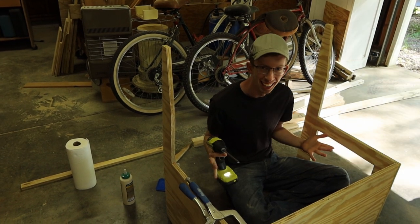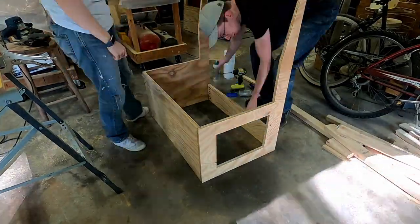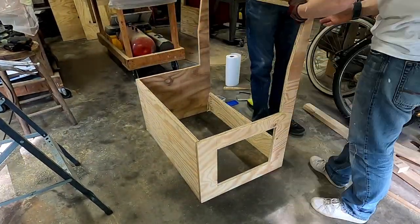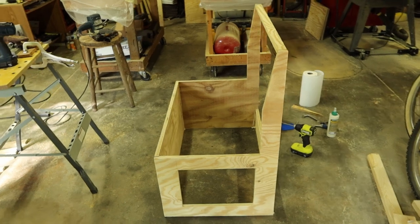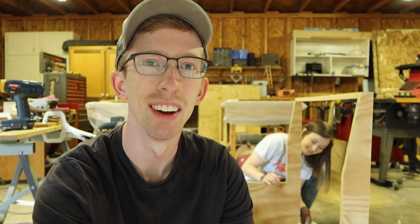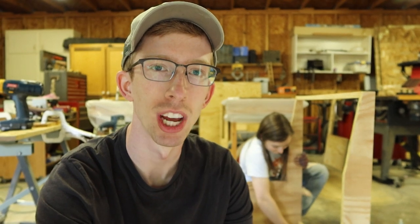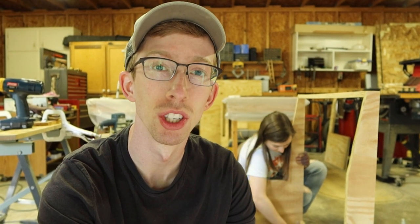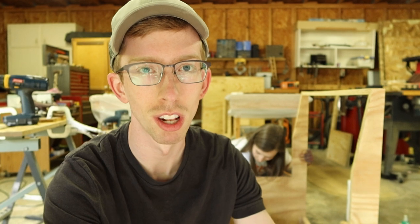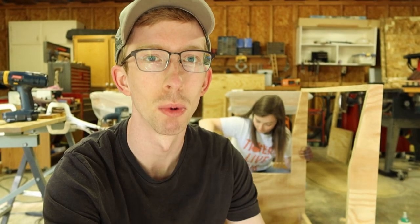Sitting in our dinette, and a few minutes ago I wasn't, and I haven't moved. All right, well, we got our first chair supports done. You might have spied the extra pocket holes on this set. That's because I did not double check the pocket hole sizing, and I drilled the holes too large. When I drilled the pocket screws through, they kind of poked out the other panel. So I had to re-drill a smaller hole so that we don't have that problem. Not a big issue, and I'll remember that for next time since we have one more dinette seat to make.